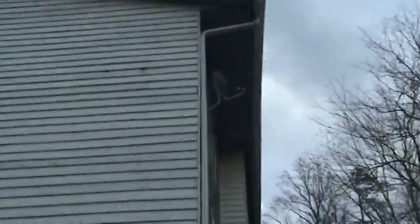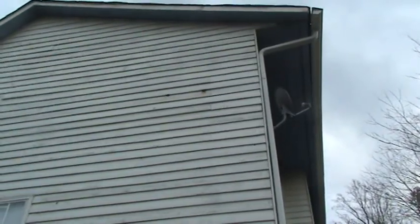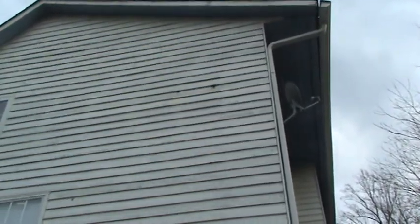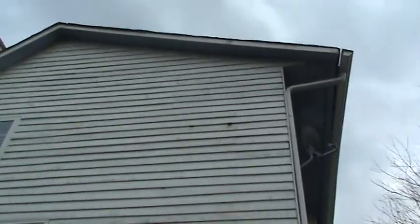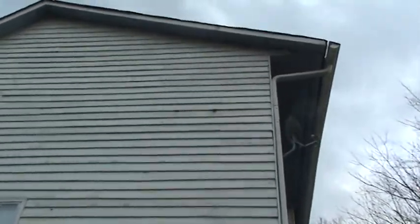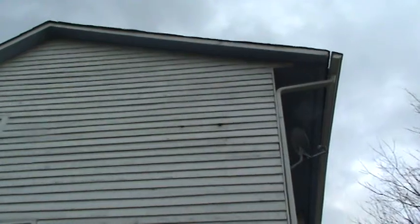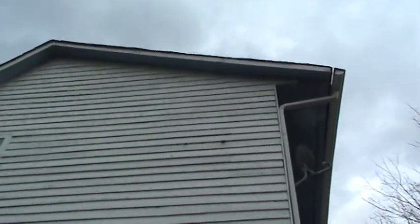He's got a couple other little things we're looking at. This is a cedar house that somebody painted, and you can paint cedar but you're going to have to prime it with a really good two-coat latex or an oil based primer. With the oil based primer you run the risk of it blistering over time. The squirrels got into these holes right here — cedar customers get talked into changing their siding out all the time, but the only thing you've got to worry about is where you've got knots. The squirrels and birds will start pecking, and the squirrels can actually sink their claws into the side of the cedar and climb right in and out of those holes. Most people think those are woodpecker holes but chances are at this point they're squirrels.